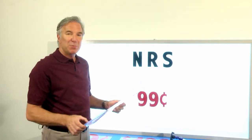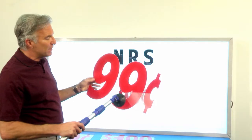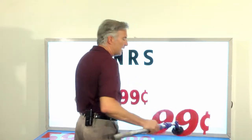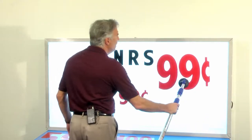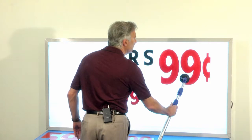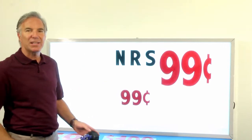Well, ask them if they've tried to put them up. Most of the time they haven't. So what I want to show you is if you take your suction cup and you keep it in the lower section right here on your panel, it'll stick in there tight enough to hold the panel, and you do it just like your letters. If it's in the bottom like that, you can slip it up in the top, and this being in the lower section gives you the leverage to drop the bottom end in the tracking just like it's supposed to be, and then twist your cup to the right — and there it is. Stays in the tracking just like it's supposed to.